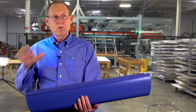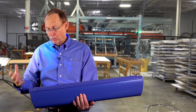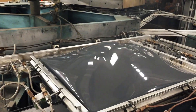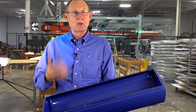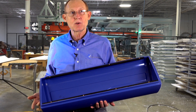So why do you need pressure in the forming process? The reason for using the female pressure forming mold here is that this customer wanted a lot of detail — a special texture on this part, and he needed to match some injection molded parts. We run this material two-color with a specific texture on the tool, and very fine detail is formed into the part. In the pressure forming process, the detail is on the front side — the back side does not have the detail. Vacuum sucks out the excess air, but pressure forces it into the mold to get that fine detail to show up on the outside of the part.